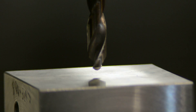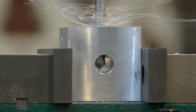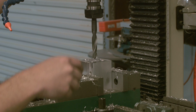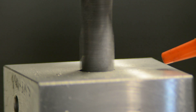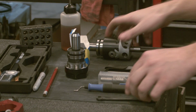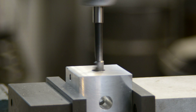Then the block gets rotated 90 degrees for each of the two through holes. Roughing out these larger holes is best done with a drill bit that is slightly undersized. I use a boring bar to finalize the hole dimension. A reamer is a more reliable tool for achieving the same thing, but you will need a separate reamer for every hole size, which can get expensive.